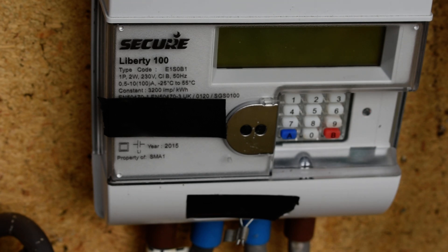On this system we have an Economy 7 setup. We don't have any storage heaters as such, but during the hours of midnight to 7am we operate on a reduced rate — we are on off-peak. From 7am until midnight we are on the normal standard rate. If we read the RO1 reading we get the Economy 7 off-peak, and if we read the RO2 reading we get the standard peak reading in kilowatt hours.